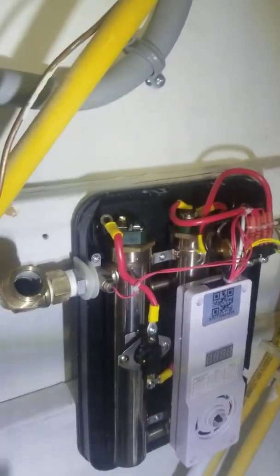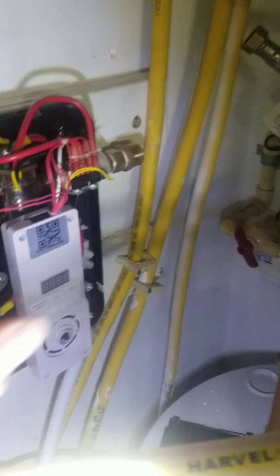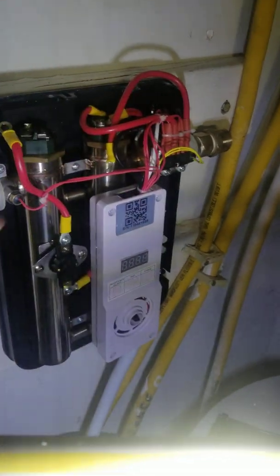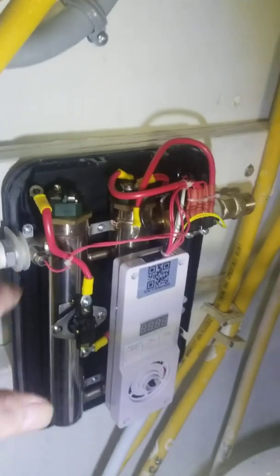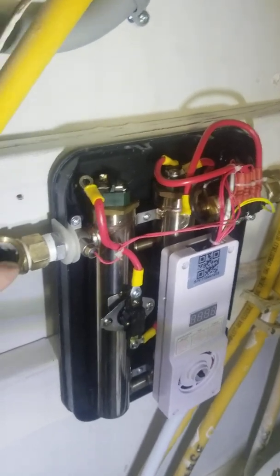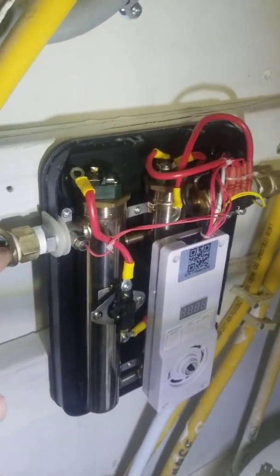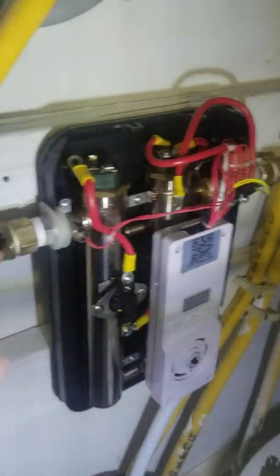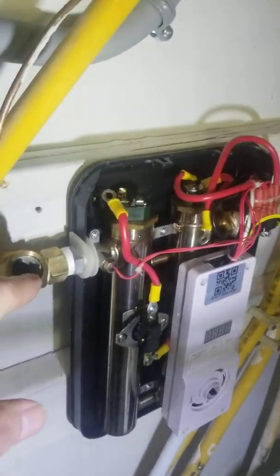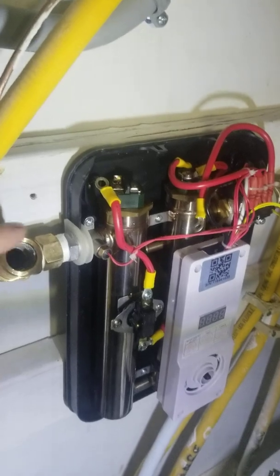I checked it — it's movable. I'm going to lift it up, pull it out, and bring it into my kitchen. Because there's an electrically-controlled valve on one side, I'm going to pour vinegar in on the other side so it fills all of this. It shouldn't leak out, and if it does I'll tilt it. I want to have vinegar in there a while — probably set it a couple hours, they say three hours. Since it's a small amount of vinegar the acidity will get lost pretty quick, so maybe I'll do the first pour for an hour, let it sit, tilt and pour it out, then add more. Maybe do that three times. I won't be able to inspect inside since I don't want to take it apart, but I'm guessing that'll do the trick.